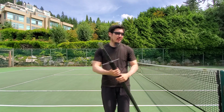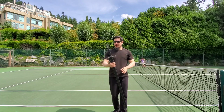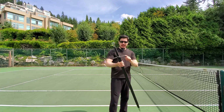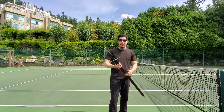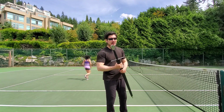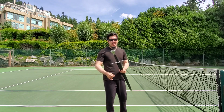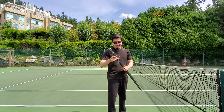If you're a sword seller, a sword dealer, you must know that usually these metal fittings, the pommels and the guards, are made of mild steel. They are prone to rust, and you should cover them with a light residue of oil. That's not hard. That's not difficult at all, because I handle swords every day, and I always wipe them with some mineral oil, and it never really rusts.